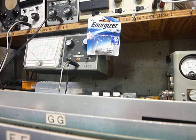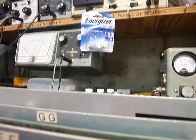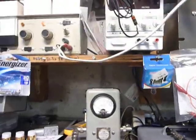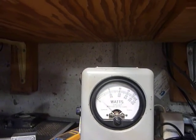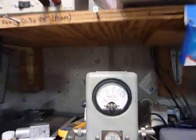This is a spare B-board with the two 47K resistors installed, just like I showed you. Snap it in place — there we go. I'm not going to open the mic gain control all the way up; I've got it about three-quarters because it actually has too much now. That control is labeled 'Mike CW Level.' Testing: one, two, three, four — the level is noticeably stronger.